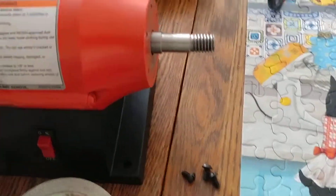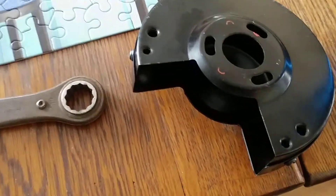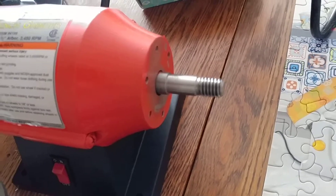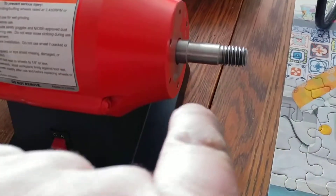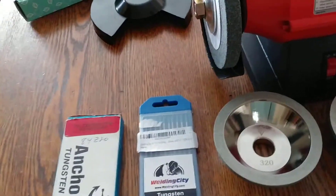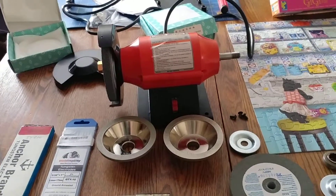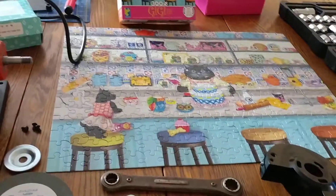So anyway, I'll make some bushings for the shaft. I'm going to revamp this entire guard and make something totally different — it'll be round like that but wider, and it'll mount in all of those holes instead of just three. I'll come off those holes with my guard and come out here for a steady rest so I can grind on one side, with an open spot on it so I can grind lathe tooling like these boring bars and that sort of thing. For tungsten, you just need a couple of little holes to get in there at the right angle. Stay tuned and I'll come back with another video in the near future with the bushings I made and a new guard setup — and who knows, maybe even a new puzzle.